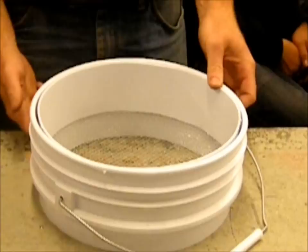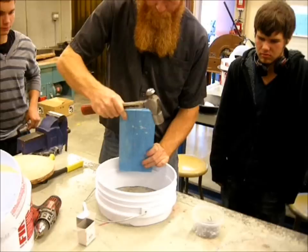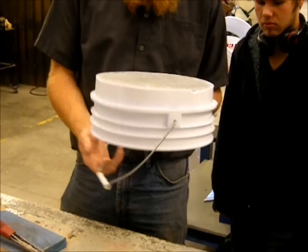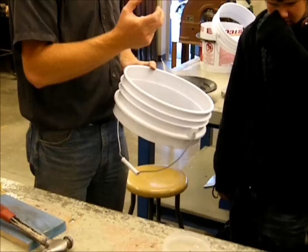Take a hammer and a little block of wood and tap it down as far as it will go — it will go right down to the bottom easily. Hammer it all the way down, all the way around. Just put the block of wood in there, put it up on that lip, tap it, move it, tap it, move it, all the way around until you're basically flat. What you don't want is for the ring to go past the bottom, because then the wire wears out quicker. Nice and flat on the bottom — this extra ring is holding it in place, and we made that ring tall enough that it covers all those sharp edges so we don't poke ourselves when we reach into our classifier.